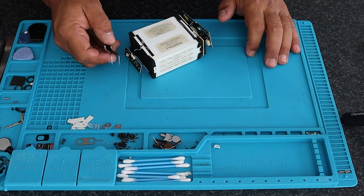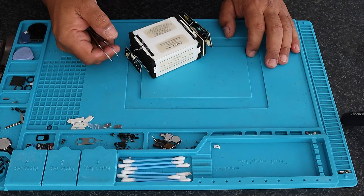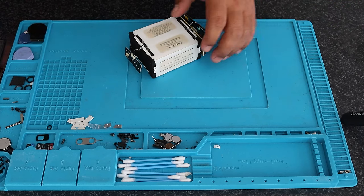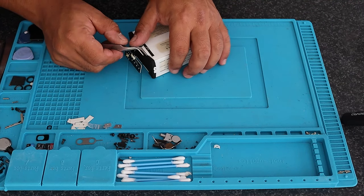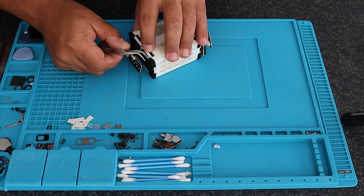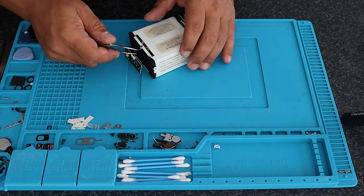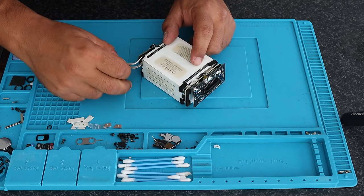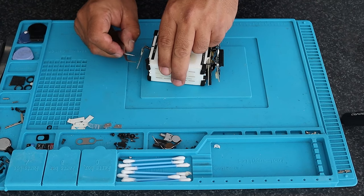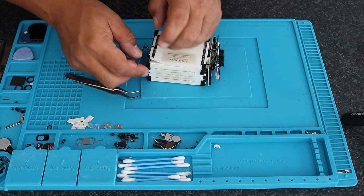I am super careful. I've had maybe one or two scares with regards to battery repairs when I first started — a couple of big sparks, a bit scary. No fires, touch wood. No serious issues, touch wood. But again, massive amounts of care need to be taken. I'm using metal tweezers, but I've completely removed the points so they are blunt. I highly recommend anyone new to this to use safety goggles, gloves, and plastic tools only — absolutely nothing else.